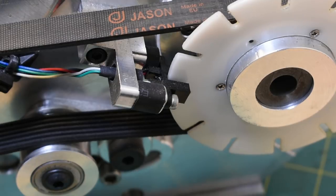It's actually super low tech. You would think they'd need a proper encoder on these, but really just a single slot disc is enough for threading. And I think they say an 8 to 12 slot disc is enough for rigid tapping. So this is a 12 slot disc. Never got into getting it working with Mach, just, you know, too busy, although I think they do support those.